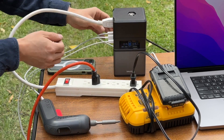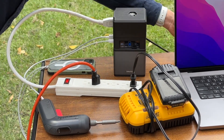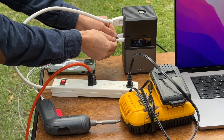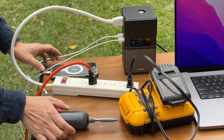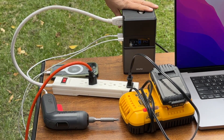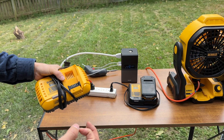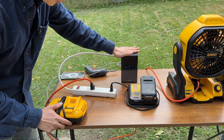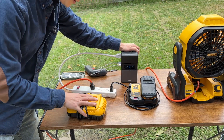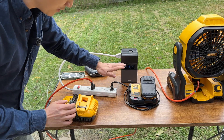It handled a little bit higher than the expected 200 watts. I'm going to disconnect my MacBook. I realized the DCB118 draws too much power and will constantly cause the unit to shut down automatically. However, there's no fuse to replace. I have replaced the charger to a DCB115 which works a bit slower but more stable.